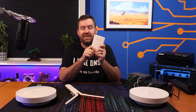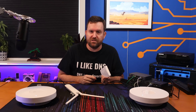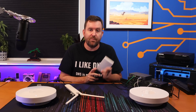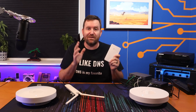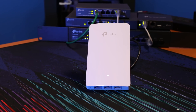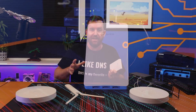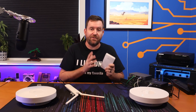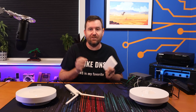The wireless antenna in the EAP615 Wall isn't as powerful as the other two access points, but it's not really supposed to be. You still get 2x2 multi-user MIMO capability with the exact same throughput as the EAP610, but the antenna gain is a bit lower — it doesn't broadcast as loudly as the 610 or the 660 HD. This is because wall form factor access points are designed to cover a single room or a smaller area. Think of these wall units as the type of access point you'd put in each room of a hotel or dormitory — perfect coverage for that room, but not going too far past the walls, which is exactly what it's supposed to do.